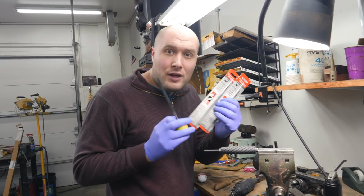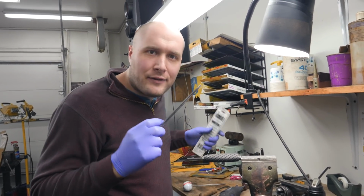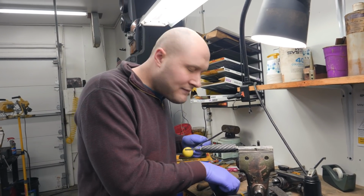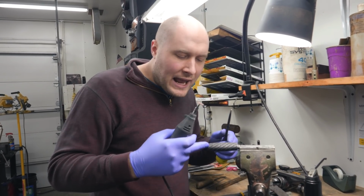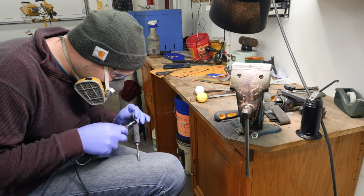I went and picked up 3 new larger Nicholson files, kind of medium end as far as price range goes. Again, immediately started destroying one. So what I've done is I've gone in with the Dremel tool. We had all the layout done and had the groove started with those other files. I'm cutting it deeper with the Dremel tool just to get the depth, because that's the hardest part.